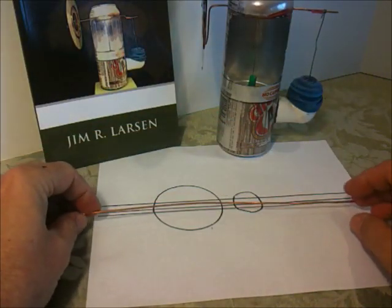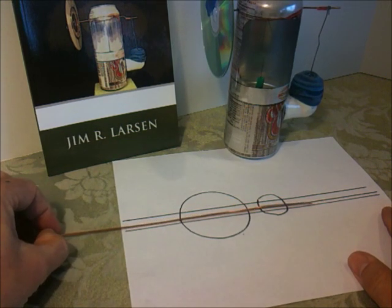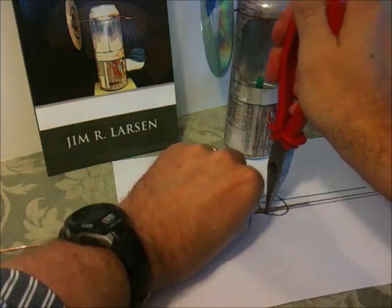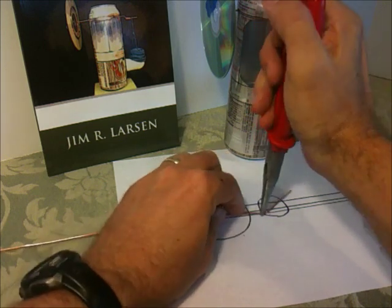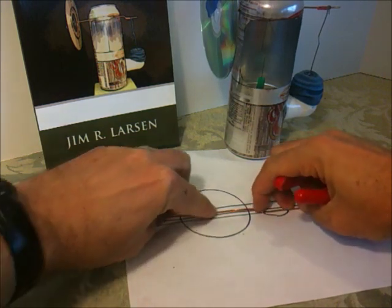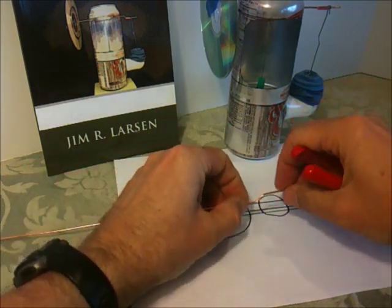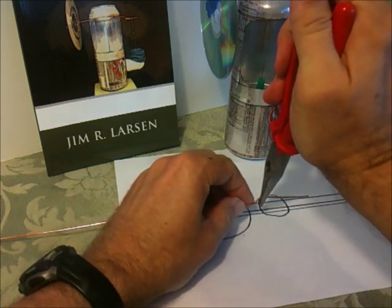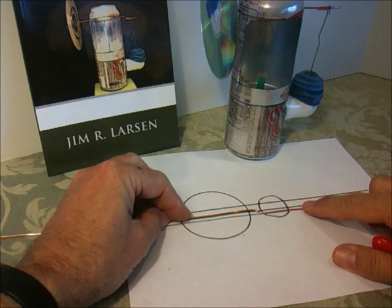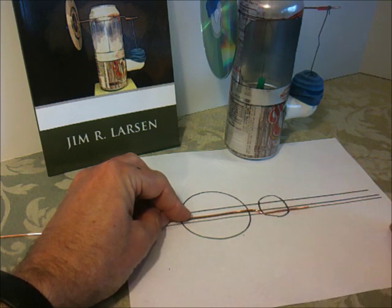The process is that I'm going to lay the wire over the template and make some bends so that it will line up with the template. Starting right here, you can see as I lay it out on the template it's getting close. I'm making the bends in the middle about 45 degrees, which makes it a lot easier to install. You can see there I have this section lined up on the center line, and the 45 degree angles come over — that's the section right there for the drive cylinder.